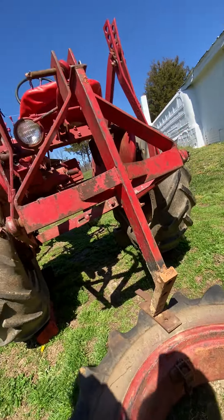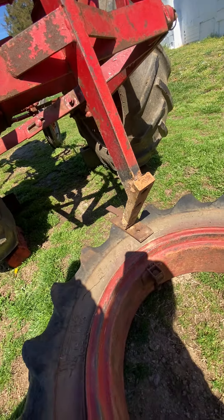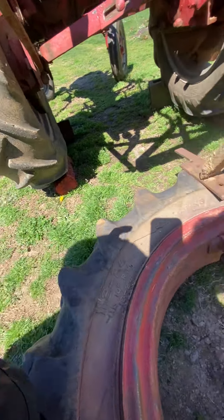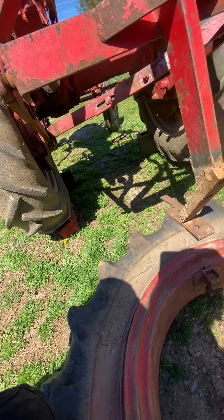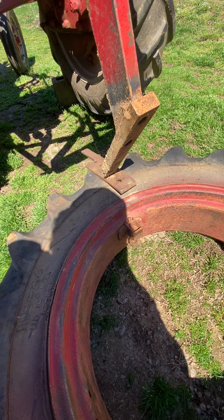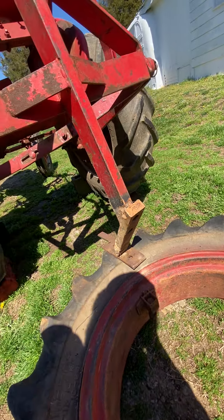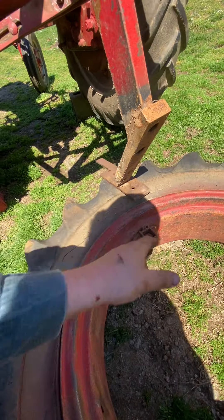This Super H has a three-point hitch on it. That's my single-shank sub-soiler. I stuck a piece of metal under it — like I said, it wasn't high enough to get under the tire, so I backed it under some four-by-fours and had my wife block the front wheels so it would roll off them, making it tall enough to get the tire on. That works pretty well — not a whole lot of labor involved and it pushes it right off. Any farm implement with down pressure — a sub-soiler or something solid — with a piece of steel under there will do the job.